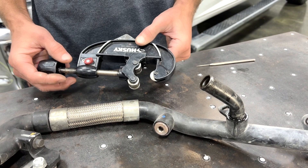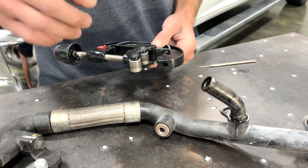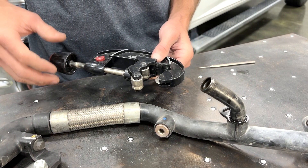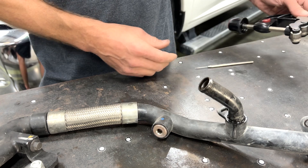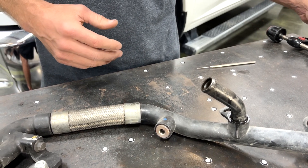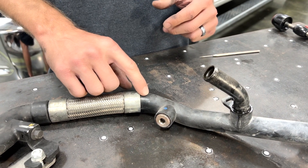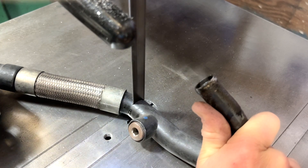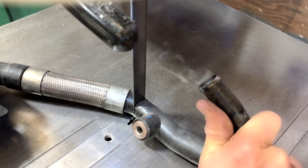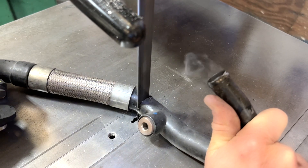As far as cutting tools go, you do not want to use one of these pipe cutters. They do create a really nice clean cut, but as you rotate them around they actually reduce the diameter of the tube, which affects the interface with our o-ring. Do not use these. You can use a cutoff wheel, a bandsaw, a sawzall — whatever you're comfortable creating a nice square clean cut with. Employing the measure-twice-cut-once technique is definitely good here. We have a vertical bandsaw that I really like, so I'm going to cut with that.